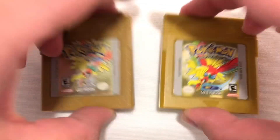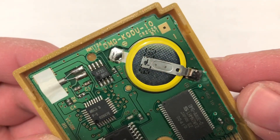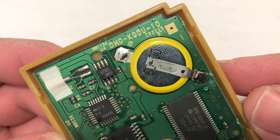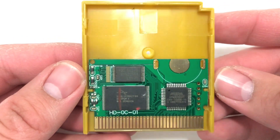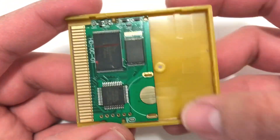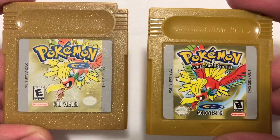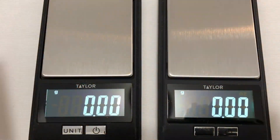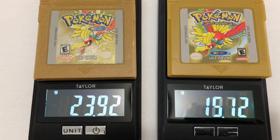Taking a look at the back, you'll even see they have different screws used to hold them together. And once you open them up, it's obvious which is which. The real cartridge will have a board that takes up the entire space, and will have a battery that manages the time-based functions of the game. The replica couldn't be bothered to include this because it is just the ROM put onto the board. But even if you aren't able to open one of these up, you could just tell that the reproduction cartridge will feel a little light. The real game weighs about 23.97 grams, and the fake one weighs about 15.19 — almost half as much.